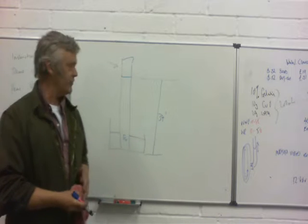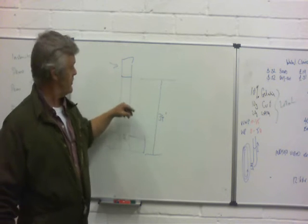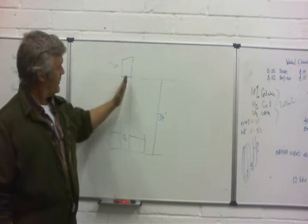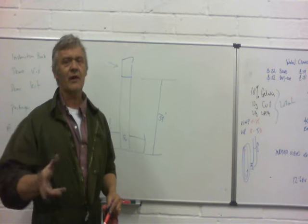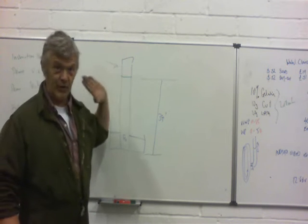In the previous video we talked about this column, where the column was greater than 34 feet, so we could use barometric head to create a vacuum here. And then if we heated that, the salt water would evaporate at lower than its normal boiling point — somewhere between 40 and 55 degrees centigrade to get that water to evaporate.